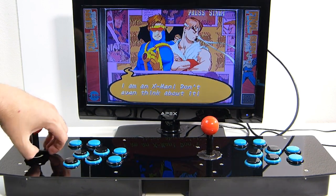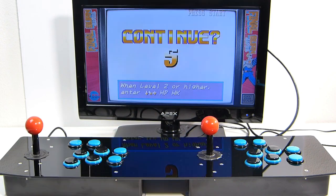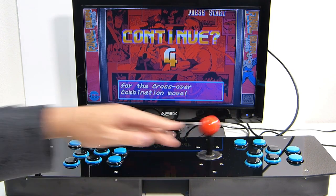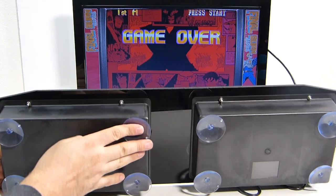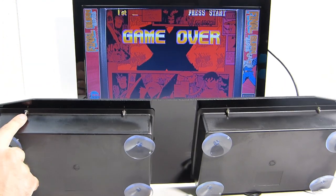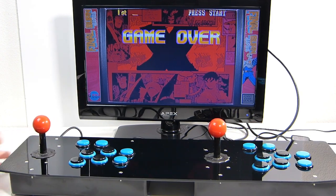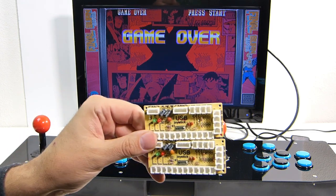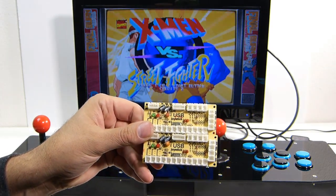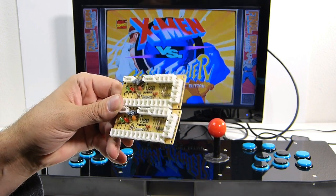Just messing with this, the stick feels okay but a little loose. These dust covers need to go — they're kind of weird looking with some Chinese writing and branding on them. The entire thing is acrylic, so it's a fingerprint and dust magnet. There are some suction cups underneath which at first seemed cheap, but they actually work quite well on my IKEA table — and it's not even a glossy table, it has a matte finish. This does not use zero delay encoders, but you can easily swap them out, and I'll be showing a diagram on how to utilize this.